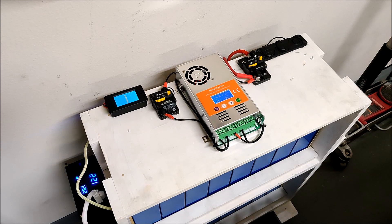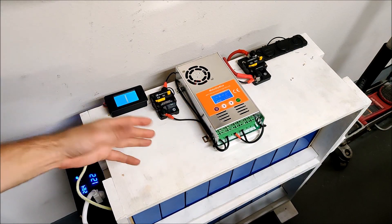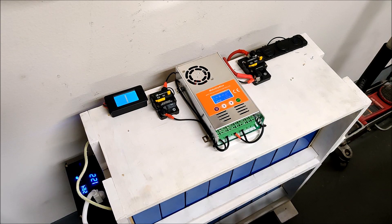So even if I had a great power supply hooked up to my ISDT, the most I can charge with is 500 watts. With two solar panels I'm already producing more than that — those two panels routinely hit 600 watts. So solar, with a couple of decent panels, can be very efficient at charging, even more so than just an outlet.